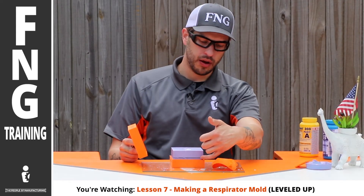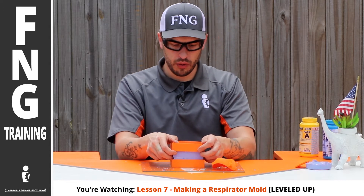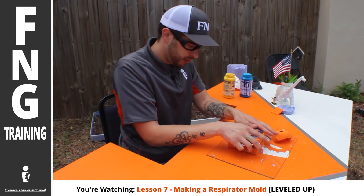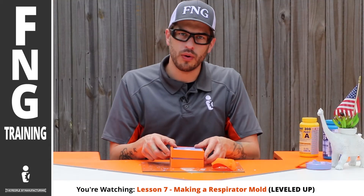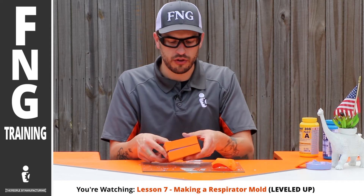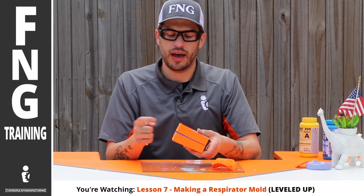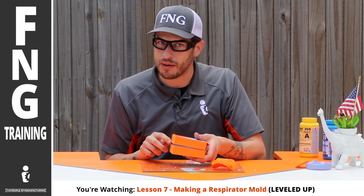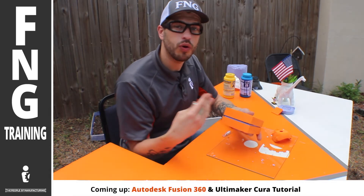We have the seam line a little bit above off center. So I can just take this extra wall we used before, flip it upside down, and push it over the side walls. The whole form-fit function of this is to seal off the edges, so now I can hold my mold where I couldn't before. Now I have a nice hard wall of plastic where I used to have a thin sheet of plastic tape — and this drastically improves my process to make this easier and repeatable.